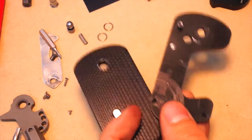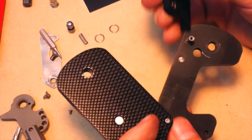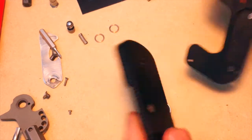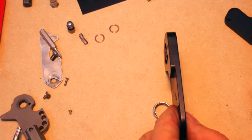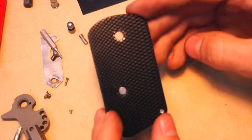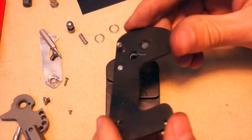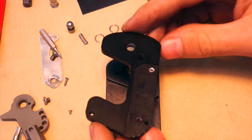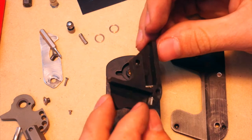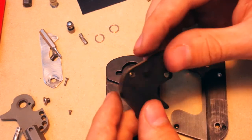So, that leads us to having basically all of our main aluminum parts, all of which are machined out of a solid hunk of 1/4 inch thick, or excuse me, I suppose this would be the bottom is machined out of a 1/4 inch thick plate of aluminum. The top is machined out of a 1/8 inch thick plate of aluminum, and the bit shelf, bit storage, is machined out of 1/4 inch thick plate of aluminum.